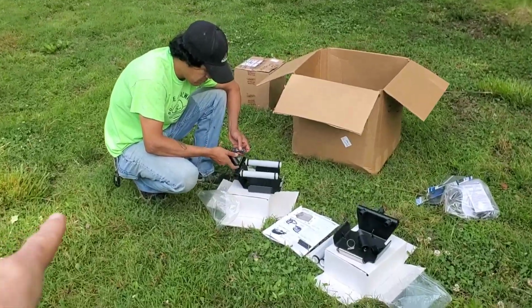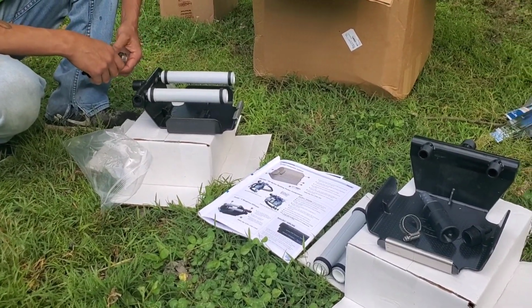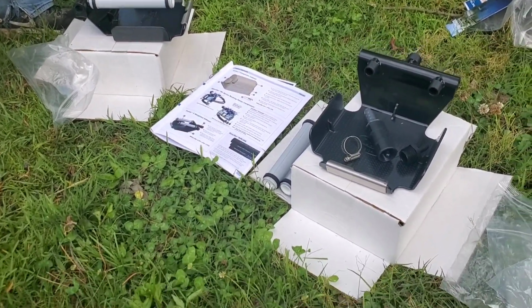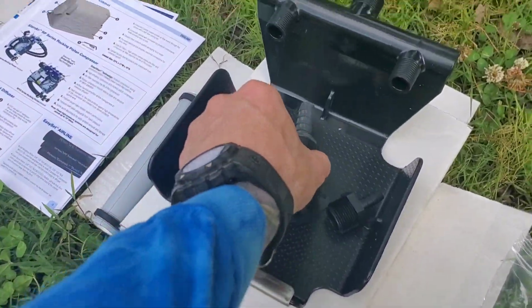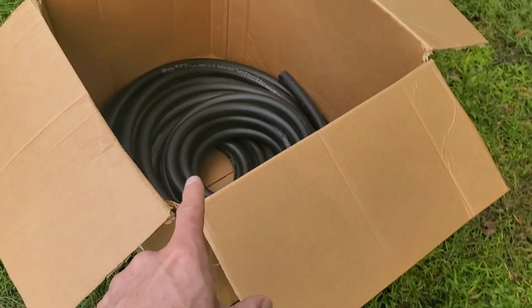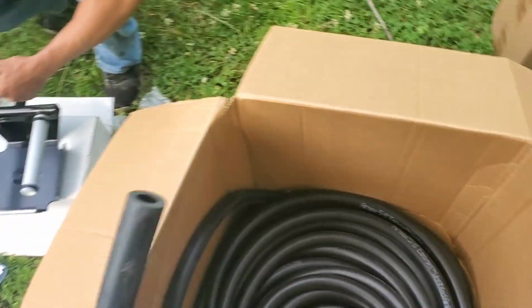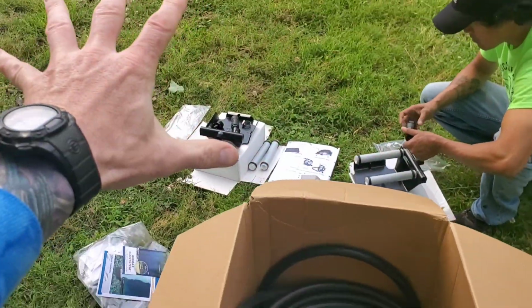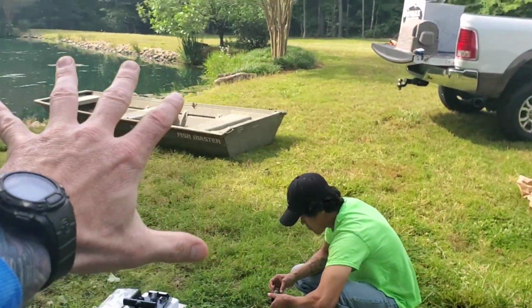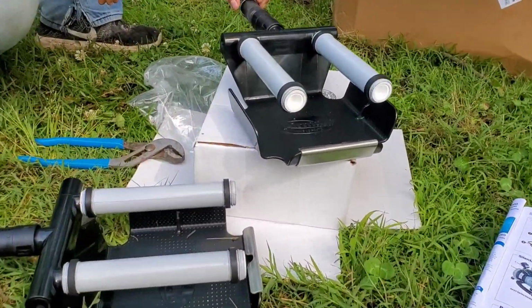Hector and I are down here now assembling together our 2 weighted diffusers that will be used on this project, and we did have to go ahead and upsize the attachment there because we needed a larger fitting for our big 5/8 inch easy set weighted air line that will be used for this aeration install for my buddy John. Okay, both diffusers are now assembled.